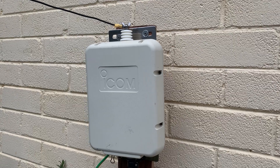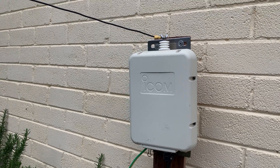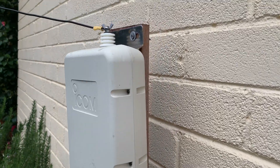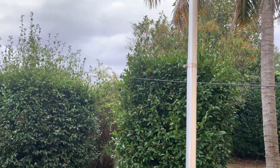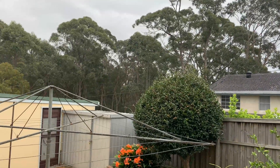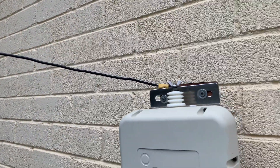It doesn't work well all the time, so sometimes I've got to flick over to the vertical to try and see what I can get at a particular time. Because it is a horizontal antenna that I've got strung out across the yard, it is propagating into the ionosphere and then down again, so the vertical is actually just going to shoot off into the horizon.